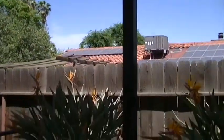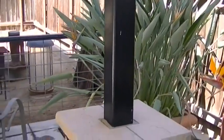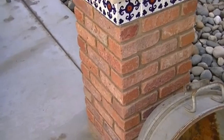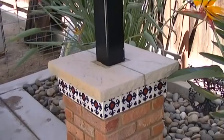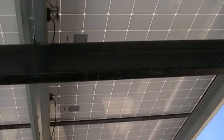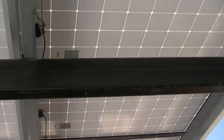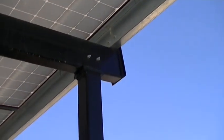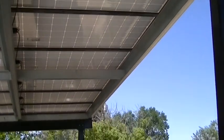These posts — look at this one over here — this post is a four-and-a-half by four-and-a-half, quarter-inch steel post, five feet into the ground with an 18-inch diameter by five-foot deep concrete footing. The customer later put the decorative brick column on there; he's a contractor so he did all that work and did a beautiful job. The posts are in the ground five feet deep, and then these beams that go across the posts are four-by-eight or four-by-ten — I think these are four-by-eights.